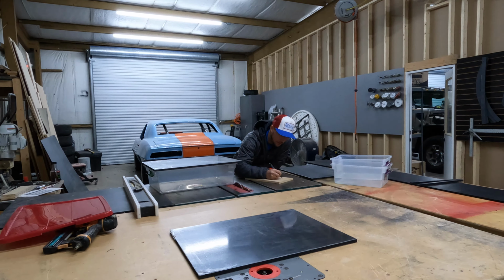I took my Dado blade out, put the regular blade back in. I think we saw that yesterday when I cut the shelves down to the right size. And now I'm gonna rip the sides down to my 8-inch back part and my 4-inch front part. And unfortunately, I'm gonna have to put the Dado stack back in here, and I've got to cut a 3-inch wide groove on here for the heat tape to wrap around to go to the next section. So let me cut the sides, and then we'll be cutting that slot.